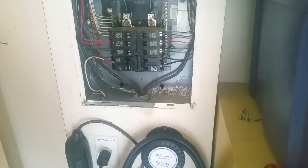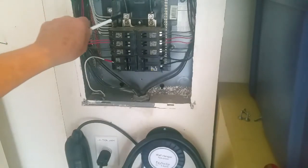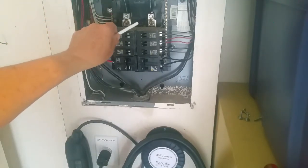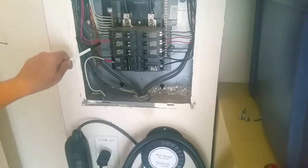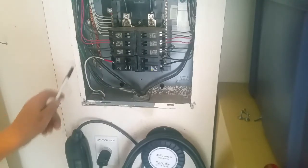Next, we're going to take off the four screws that hold on the panel. So now we have the panel off. Before you go into this next step, it's a good idea to go outside your home, go over to your electric meter, and turn off the main breaker. Because this is where your power comes in right here — 120 volts on each side, that's 220 all together. And of course there are lots of grounding bars, bus bars and grounding here and over here.